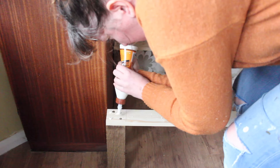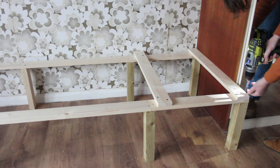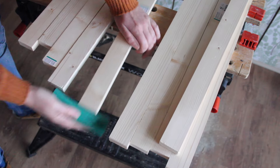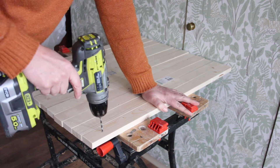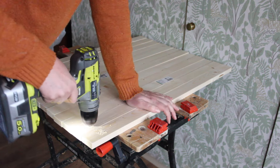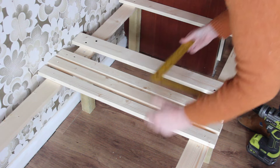Let's put the sofa frame together by gluing and screwing in the front, the back, and the piece that's going to sit just where the single mattress finishes. Then it's time for the slats — I cut these out to size, sand them nice and smooth. I'm going to pre-drill holes a couple of centimeters from the end where you're going to screw it into the frame. Pre-drill these because you have less chance of the timber splitting. Screw the slats into the frame, making sure there's enough space in the middle for one whole slat plus one centimeter each side.